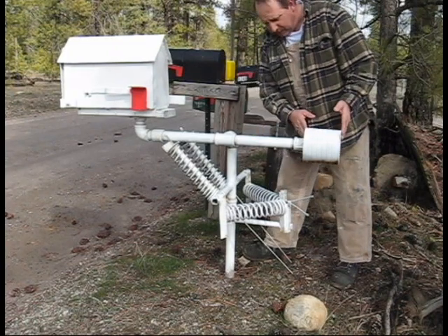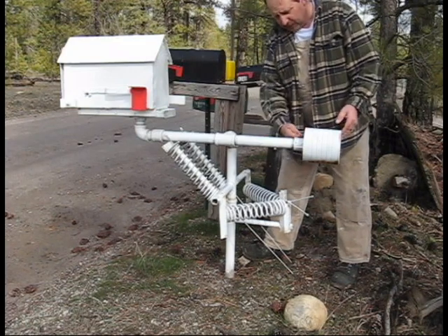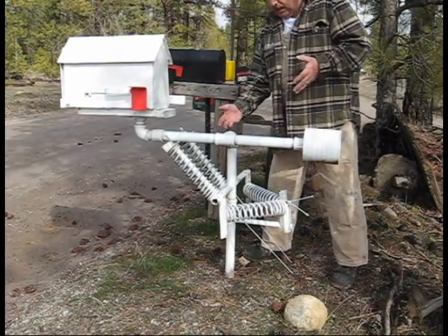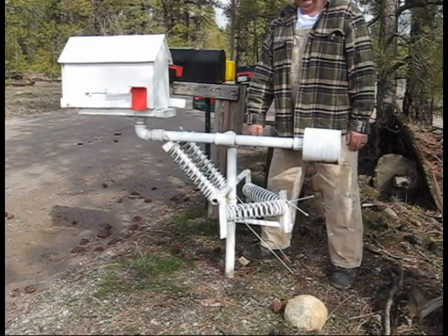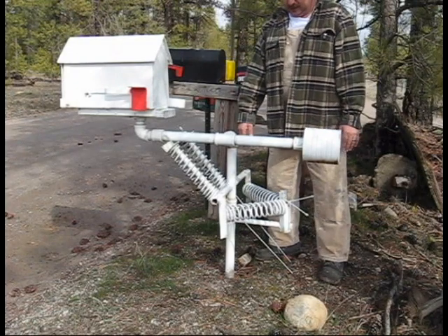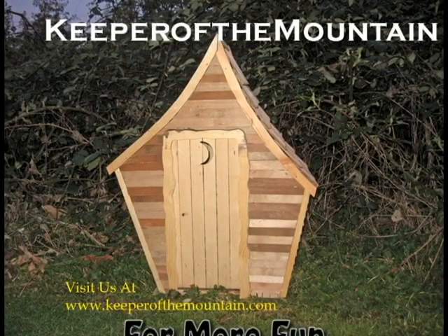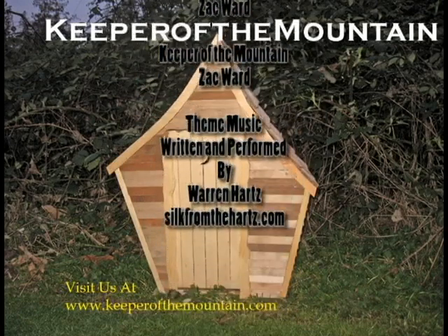This here is just a piece of inch-and-a-half water pipe stuck in concrete in a coffee can. Once it hardened, it works as a good counterbalance so it's not all this weight hanging down all the time, and when it gets hit, it easily lifts up and plops back down. This mailbox has survived every plow hit since with no perceived damage. But as you saw, the neighbor's mailbox isn't so fortunate. You don't want to have to fix things over and over again — you want to fix it once and be done. Although I do reckon the snowplow driver had to fix his plow a time or two.